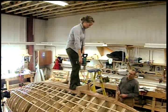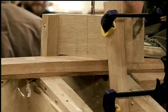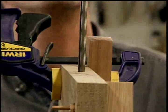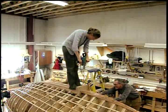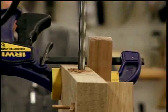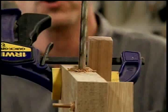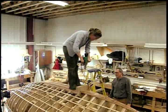On top of the keel, she's got a jig that is going to help align the drill bit as she starts drilling it, and she'll be working it down through this jig, through the keel, and working the drill bit up and down so it releases the chips — going very slowly with it, so she takes a little bit of a bite. She can feel it digging into the wood, and then backs it out so that it releases the excess chips.